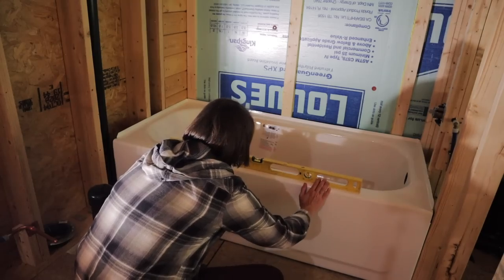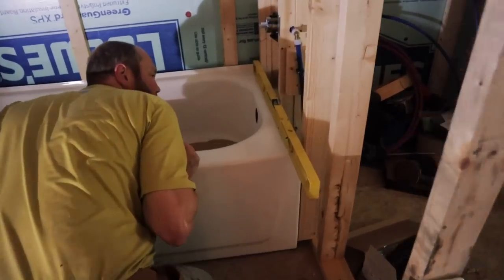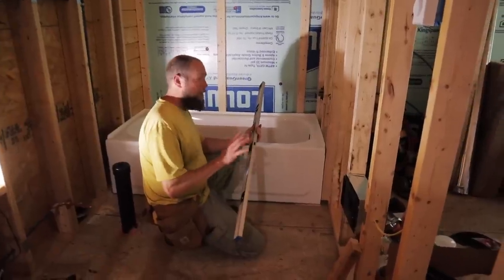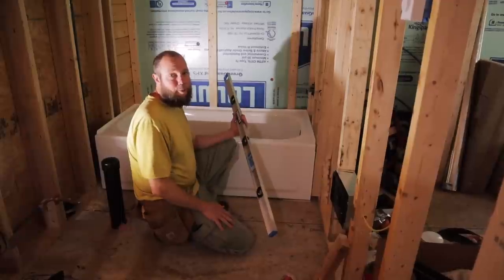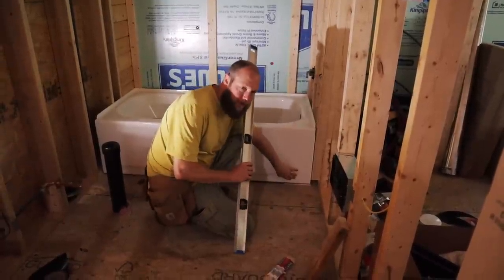It's not perfectly leveled. The way that it's going is the way that it would be draining, and it is not between the two lines. We don't have a level foundation — it's probably just one of the joists that popped up, right on that joist. So we checked the level both ways on the bathtub and unfortunately the floor is a bit out of whack. This just means we need to shim it up and attach our ledger board across the back. We've taken some measurements, we're going to put that ledger board up, then shim up the front edges to get level.